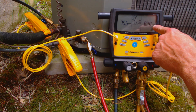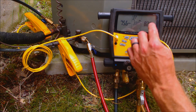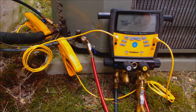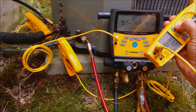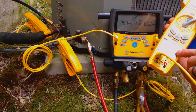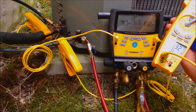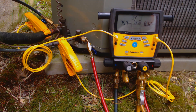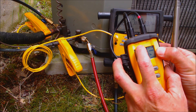If we wanted to sync for our outdoor dry bulb temperature, we press up and come over to outdoor dry bulb, then hit Sync. That's now looking for our outdoor temperature. We hold our sync button in, and it was able to read the same temperature. Now this will automatically calculate our target superheat the entire time while the system is running — this sensor stays outside, and the return probe stays inside.